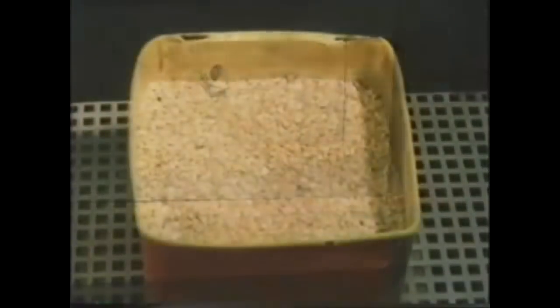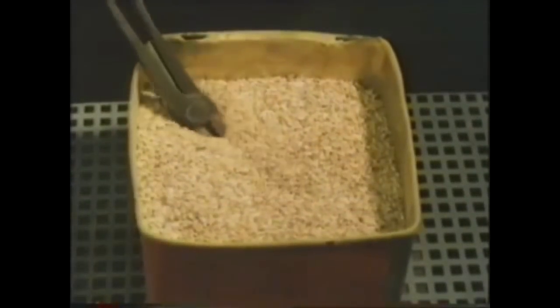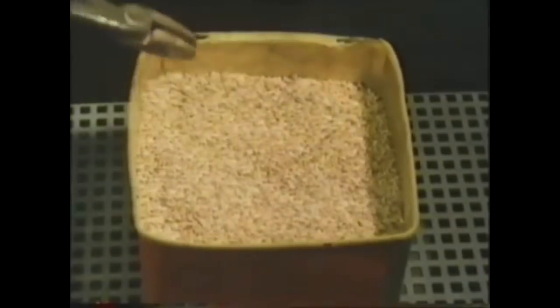In a third experiment, the rod is again heated to the same temperature, and then it's quenched rapidly in water. That makes it hard and brittle, just as in the first experiment. Then the rod is put back into the furnace, and this time heated to a lower temperature. After this, it's cooled slowly in vermiculite. It could also be cooled in air. This process of heating and cooling is known as tempering. It's a carefully controlled compromise between toughness and hardness. The rod doesn't mark too easily with a file, and it can be flexed in the hand.